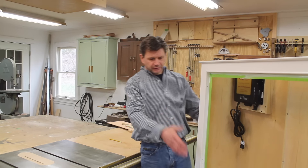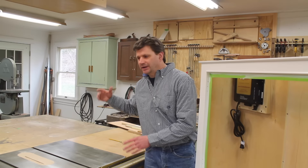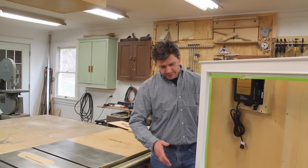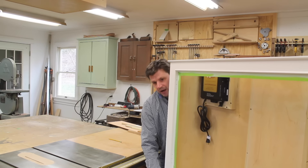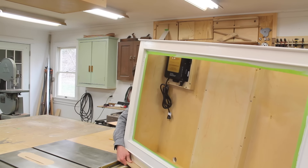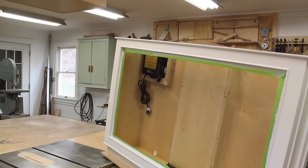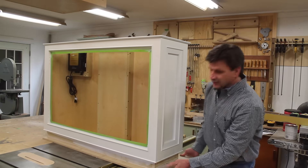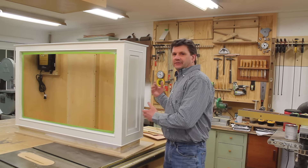In this case, I've got a little table that's off camera, next to the table saw. Unfortunately, I use my outfeed table as my assembly table just because the shop's kind of small. What I'm going to do now is pick the cabinet up from the base of the MDF it's sitting on, get half of this MDF up onto the table saw, then position it. Now I can get on the other side of the cabinet and slide this in place. It's just one of those tips for when you're working by yourself — you have to be able to move things around without hurting yourself or hurting the project.